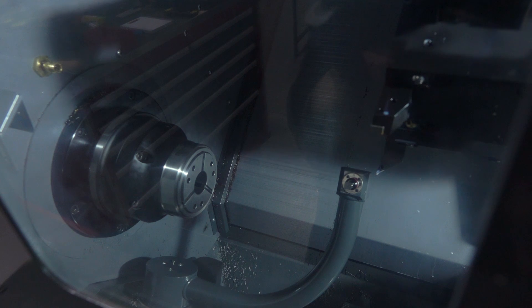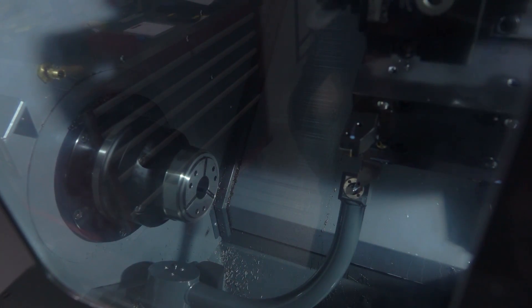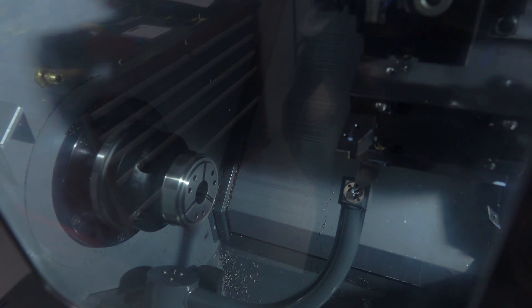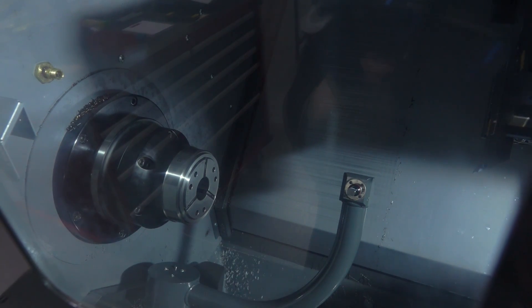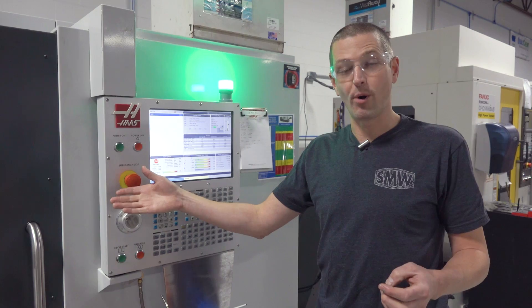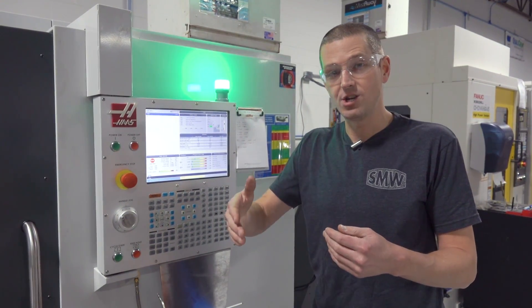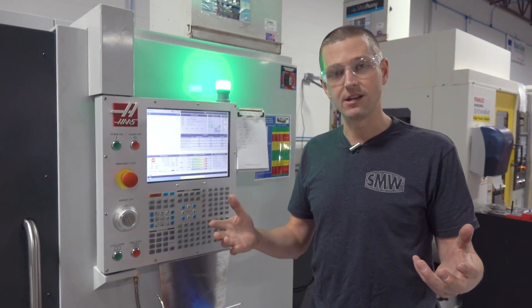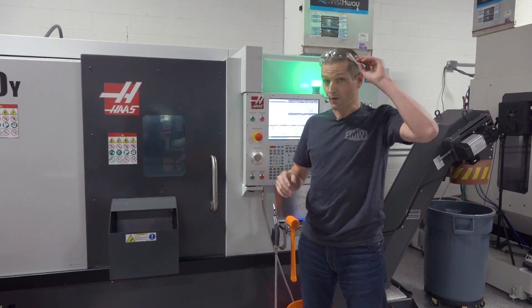This gives me two different ways to increase process reliability. Number one is the Haas ATM — I can use the tool management software to track things like time in the cut, or how much spindle load is being used by a certain cut, to see if an insert is broken or worn out. What you can also do is program mid-part tool checks: it can come in and check, and if you've broken or fractured an insert and it's changed by more than a certain threshold — a couple thousandths of an inch, for example — it can either pause, feed hold, take a sister tool, etc. Super cool.